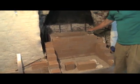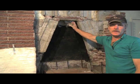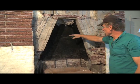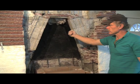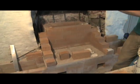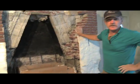We gotta get this back chimney ran up. Or actually, when we get closer to this, we'll start corbeling like this old wall was. We'll corbel that down so that we can get into an 8-inch round. We'll have to have a transition, and somewhere in this area to be determined. When we have that transition, we'll also have a damper with a shut off, and we'll probably run it through this wall, drill a hole so we can have a handle that will slide it on and off. Once we get that up, then we can run this firebox on up in this front part, and then we can run the side channels. After we get all the side channels and the firebox up, then we can put the stone veneer on the outside.